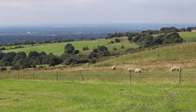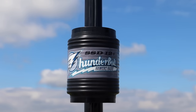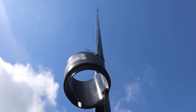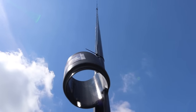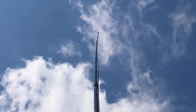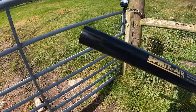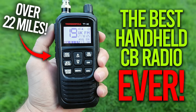We left the testing there and got some lunch. I wanted to make some contacts further afield but the constant pile-up on channel 19 made it impossible. The antenna performed really well, and Hawkins have recently upgraded it adding an improved radiator section and extra sealing. This isn't a paid or sponsored video — I bought this antenna myself. It's basically a half-wave end-fed dipole, 5.5 meters long, with a center frequency of 27.5 MHz and a 1-to-1 SWR. It has a gain of 3 dBi and will handle 600 watts continuous or 1200 watts in short bursts. It cost me around £32 and fits in a really small bag, so it's perfect for portable work when you need a quick setup. The fiberglass pole is 7 meters long and cost around £30.